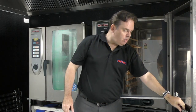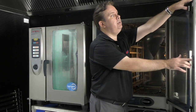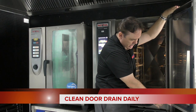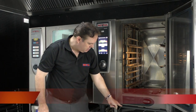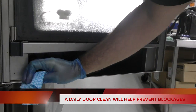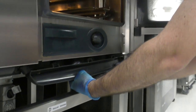While you're doing that as well, you'll notice there's a drain that's fixed on the door. You can get the soft cloth again and wipe that out. When you close the door and the glass, just push it back into place. Any steam or grease will run down the door, into this drain, down to the corner of the door, into this drip tray, and away underneath the unit to the drain. You will occasionally have to clean this — it's probably a daily thing. From time to time it may get blocked with chicken fat; you can unclick it, take it out, wash it, and put it back in again.